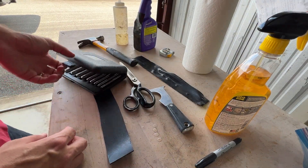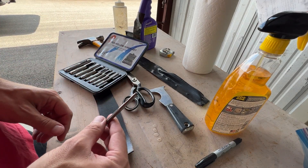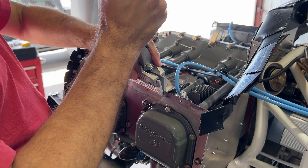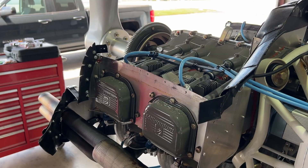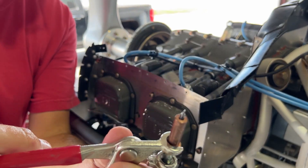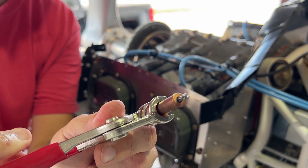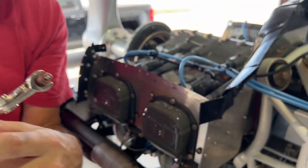This is just a leather punch tip. I've had success just drilling these out but these make nice holes. This is called a cleco. When you use these pliers to squeeze it, it thins out this center post and then you stick it through two holes and let go and it thickens up and will grab two thin pieces of material and hold them together.